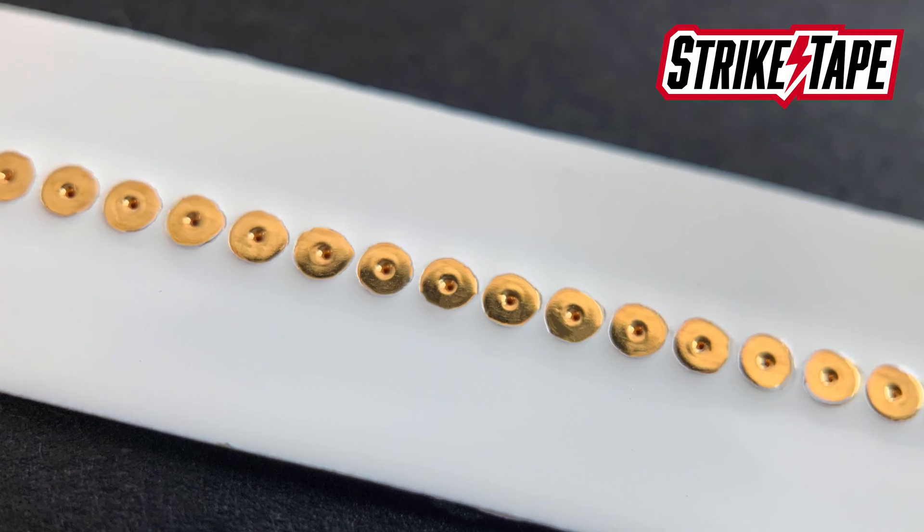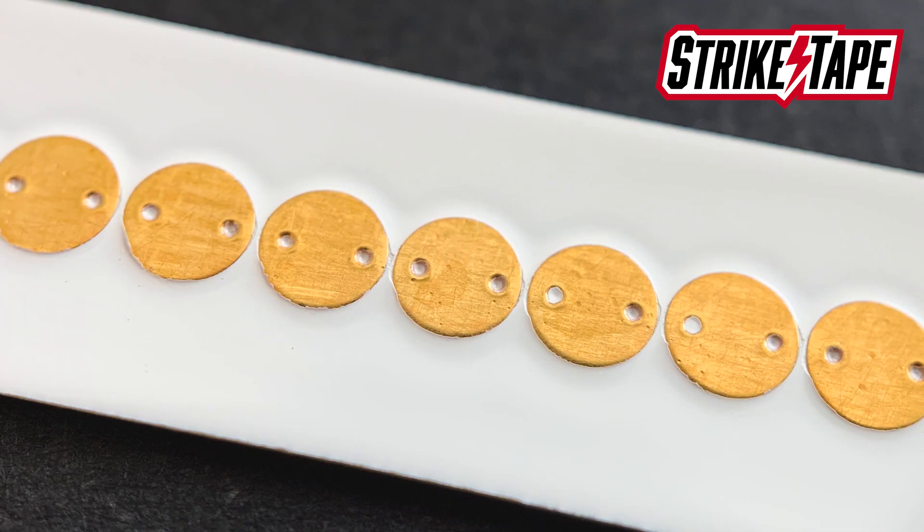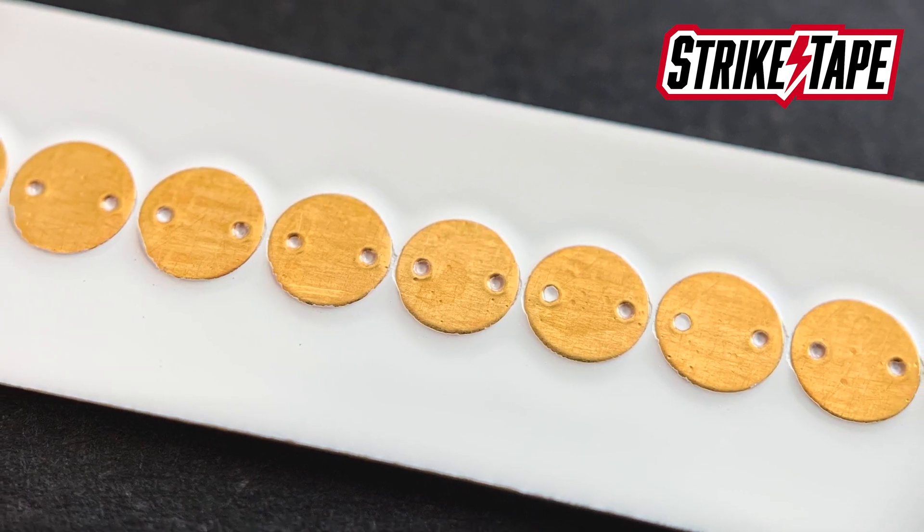Keep your receptor systems, keep your down conductor systems in place, and add some lightning protection improvements to get the lightning energy to your receptors. With our Strike Tape product, which is a segmented lightning diverter, we can apply that product directly to the outside of the blade with no structural modifications to the blade itself.